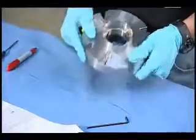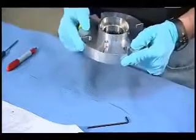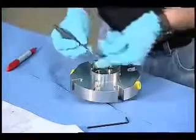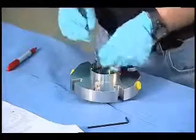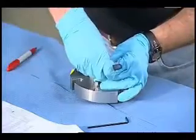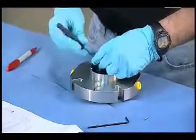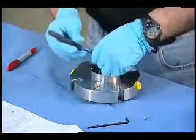I still have a long way to go because this is a dual seal — I have another seal face, another O-ring, and two sets of springs. What I'll do is take out all the springs. These are all the outboard seal springs. I'll take all of those out and show you what I do when I inspect these.